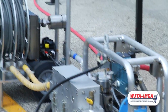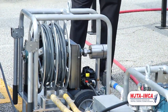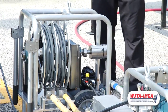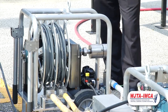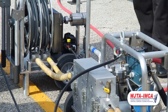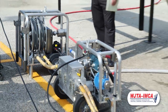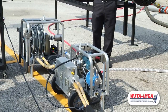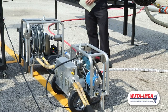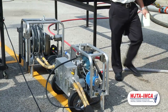This is connected to an all-new SafeFlex hose reel used to manage the hoses, so you don't have hoses laying out behind you at the work site. You can spool the lances in and out as needed. It's connected to the SafeFlex 2001 by a high-pressure line and a single air line, which signals the hose reel to do what it needs to do. It has a single air motor providing continuous tension so lances don't come unspooled, and a single high-pressure seal feeding both lances — a simpler, smaller, easier-to-use version of the hose reel.